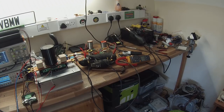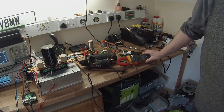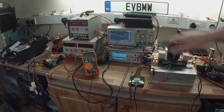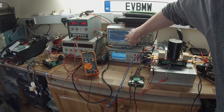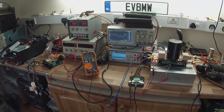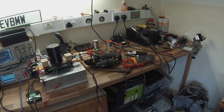Now we pick up speed. Now I'm putting 40 amps and 3.2 volts into our trusty starter. You can see on the oscilloscope our lovely overshoot. This is the part that we need to watch for. So our controller is now speed controlling our starter motor. Let's go up to 20%.